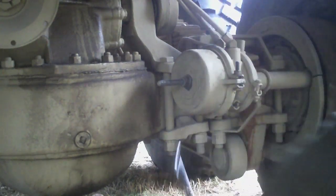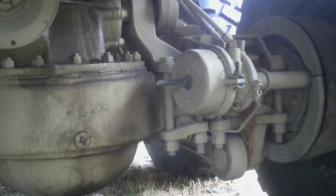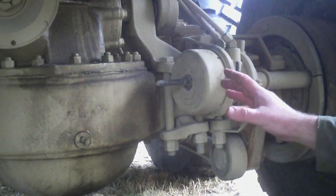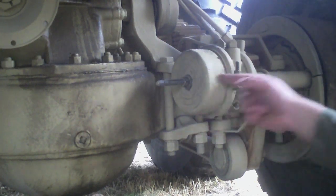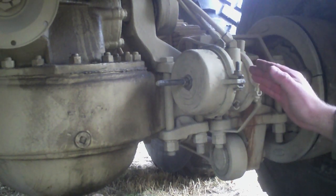This is the part where I struggle — I never know just how far to take them. You don't want to go too far, you might break a spring. You don't want to go not far enough because then she'll pop off. That said, if God forbid the ears or tabs break off on that caging bolt, it will launch this case and the spring backwards, and it will launch what we're going to call the spring seat — the metal piston — forwards. So you don't want to be in this line of fire if you can help it.